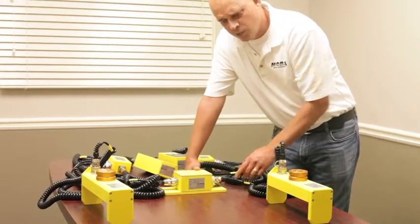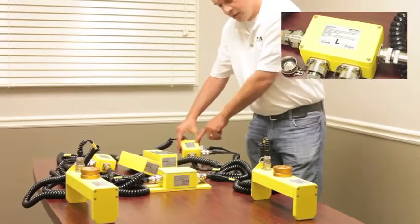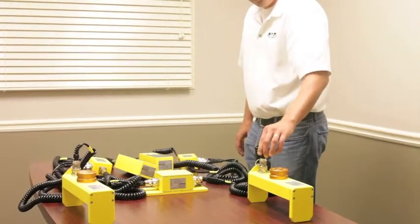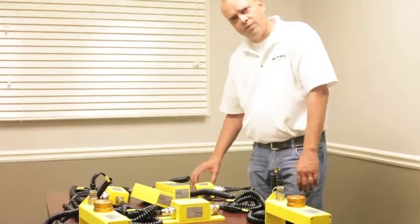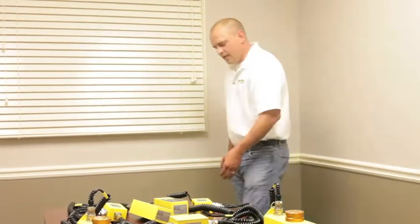We will continue on the left side of each slope box. Here is a 26-20 cable that runs to your left side junction box in the slope portion. Here is your sonic ski on your left side with the 26-20 cable, part number 040-2-02620. It will run right into the grade port on your left side slope box — same setup as the right side.